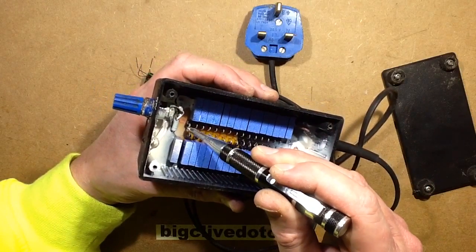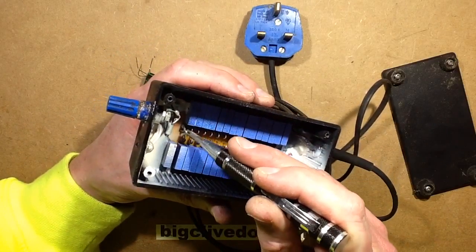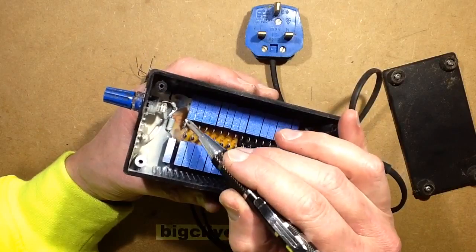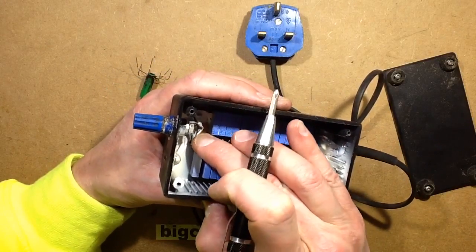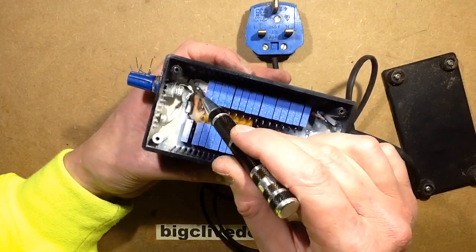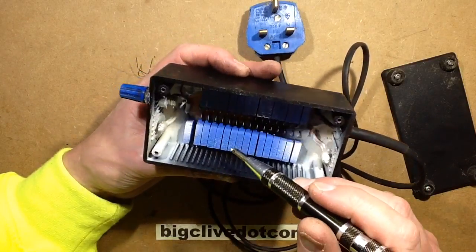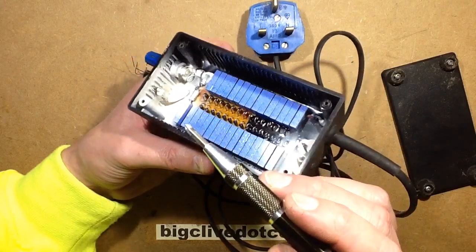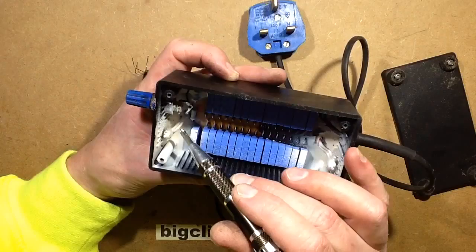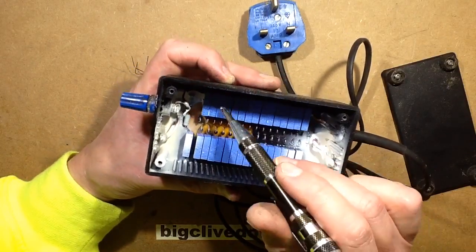Oh, look, there's a bit of green verdigris actually. I suppose oxidised copper, which is verdigris right enough, has just formed in there at the highest voltage point. I wonder why that particular one. Maybe it's because it's in the vicinity of some other connections. It's got the two high voltage output resistors. It's got the little blinking neon here that should have a little capacitor across it, which is probably buried in the back of the... Maybe it's just that the capacitor is in series with the output. I'm not sure. It's a shame it's potted.